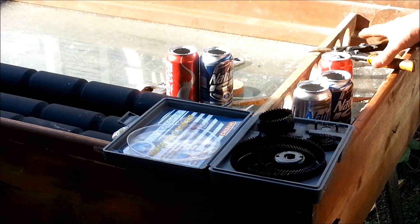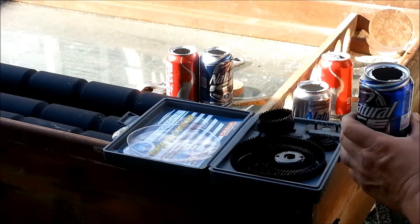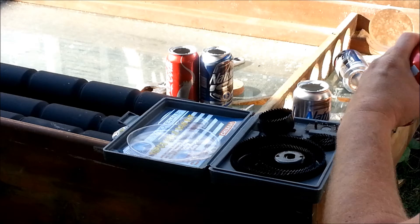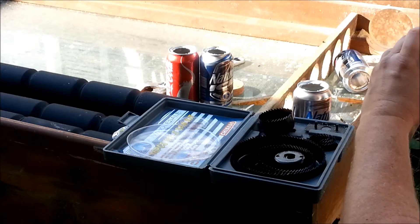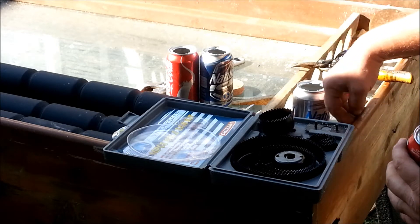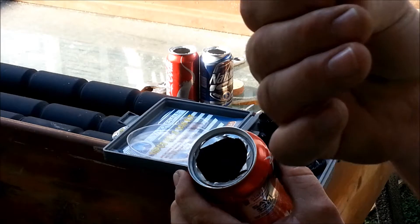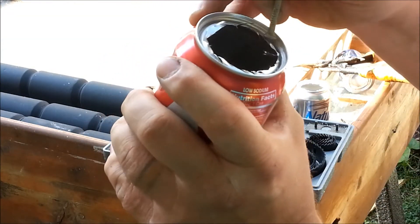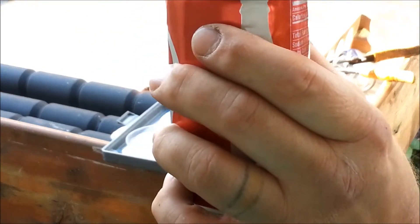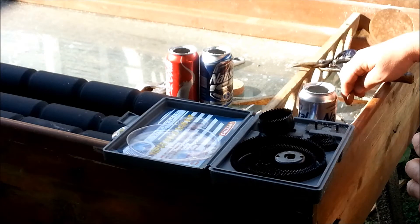In this clip I want to explain a few things I've done. Earlier I showed you how to cut these out using these tools, which works really well. The only problem is it leaves a little burr. I showed you earlier how to solve that, but didn't show you what I use. I'm just using a nail — I take it and spin it around there and push that burr down. That way the bottom and top will seat good together. Otherwise they won't.